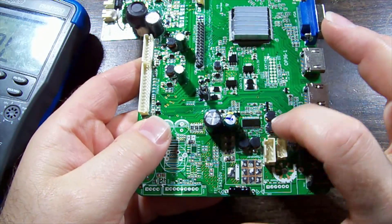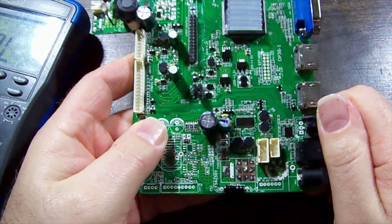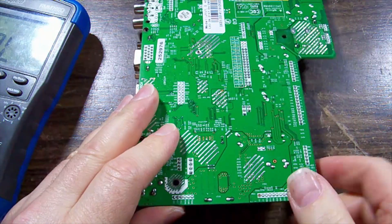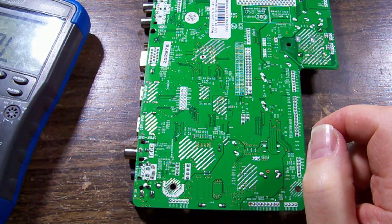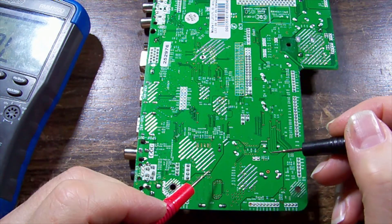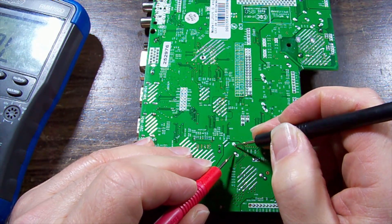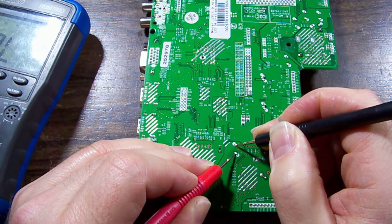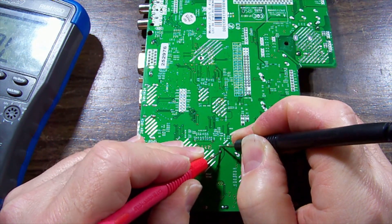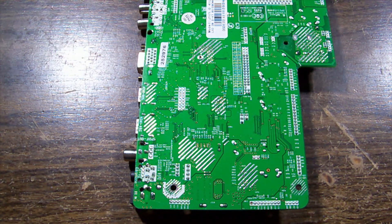There are quite fat traces going from each coil into that chip, so hopefully the chip is good. We should check the output capacitors too - measure across them for resistance. While we may not have a low resistance on the input, if there's a dead short on the output it would overload the input as well. Probing those capacitors - I've got thousands of ohms on both. That's absolutely fine, so I'm going with the blown fuse being the only problem.